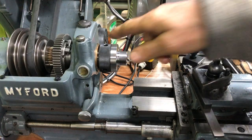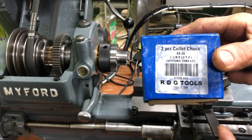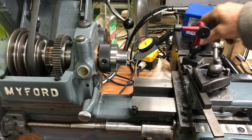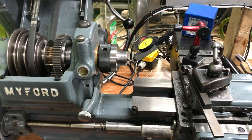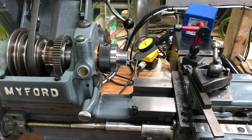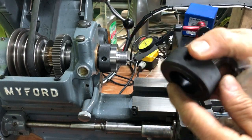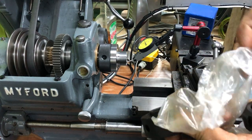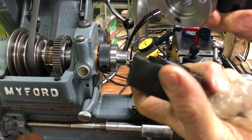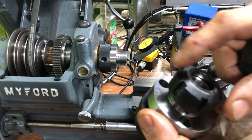I'm now testing after having set up a collet chuck from RGD Tools. This is the smallest one I think, the ER25, so suitable for a Myford. It screws on to the spindle nose, and then you just machine down this collar so that it fits. That's the very simplest setup, and then you of course attach it with bolts there.